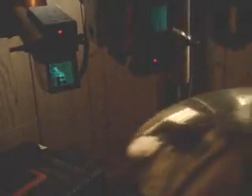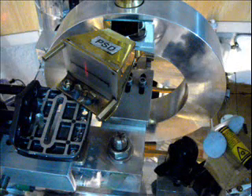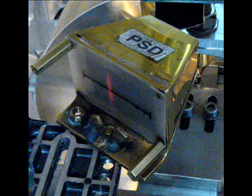The sensors: we have two very high-accuracy Keyence LKG laser rangefinder sensors, which are accurate to closer than one micrometer. They look at the pendulum rods sideways — one near the end of the pendulum's elliptical path to measure the precession, and one near the middle to measure the minor axis. Here you see the laser spots on the target as the pendulum oscillates. We can also measure the azimuth angle of the wing, a very important parameter. A laser beam is reflected by a mirror fixed on the upper part of the wing, and impinges upon a Hamamatsu position-sensitive detector housed in a light hood. We can measure the angle of the wing to about ten minutes of arc in this way.